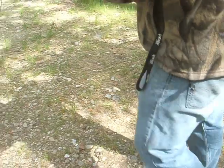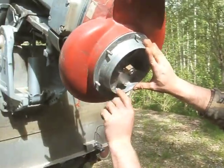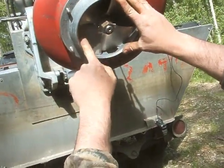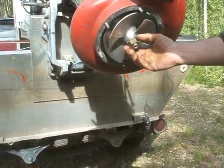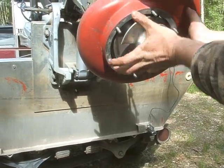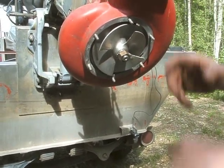When this is on here, you can actually get a feeler gauge in there. I don't know what the tolerance is exactly, but you can see how close these are to your liner — you want to keep them close and tight. If they're loose, that's where you lose your power. And you can see on here how there are shims, so you can shim it down. You basically take one of these shims and put it above it, and we'll shim that impeller down.